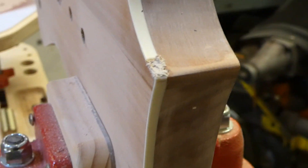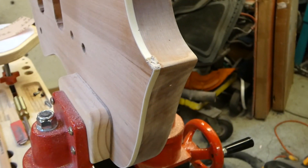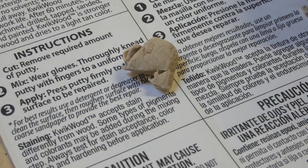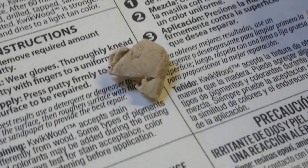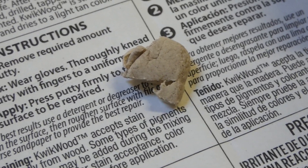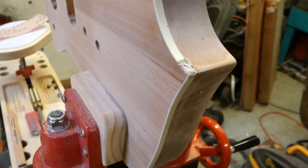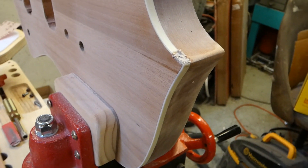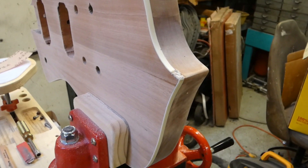I've got the wood filler on there. It's kind of a two-part epoxy putty — you cut off a little bit and then knead it together. It's J-B Weld Quick Wood. It comes out kind of that color after you knead it all together. I only used a very, very small amount, but it's better to have more than not enough. It says you've got about 60 minutes to wait and then it's ready. So I'm going to go do something for an hour.